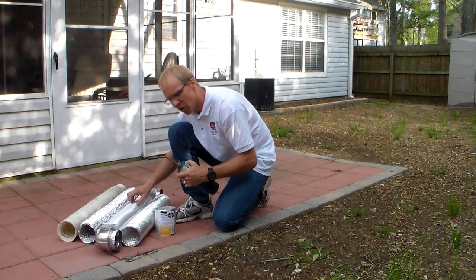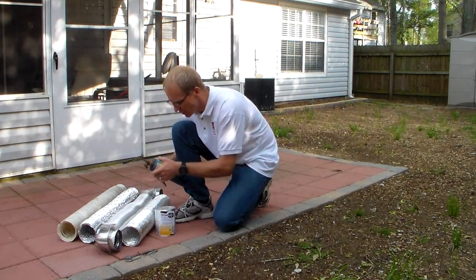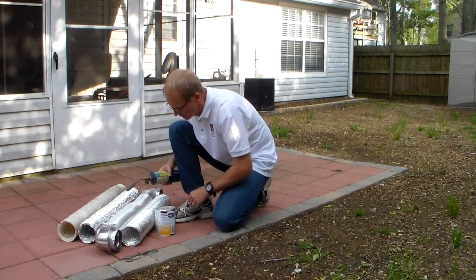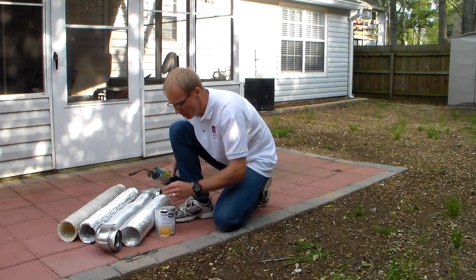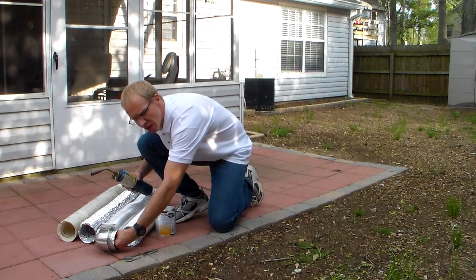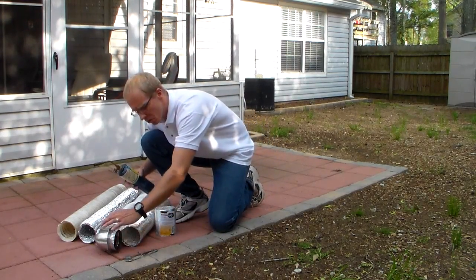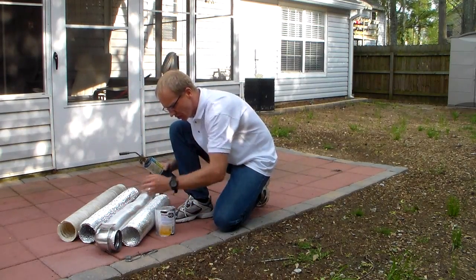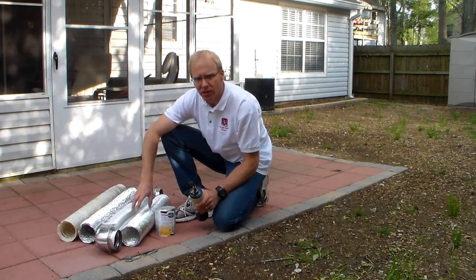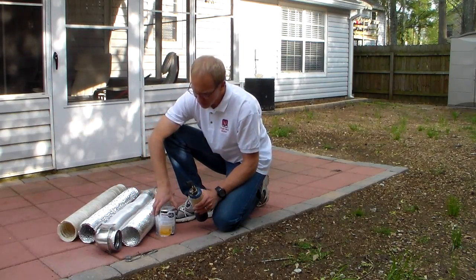The next one: hard, rigid aluminum metal. Very good one to use. You can see it heats up but no fire — it's safe. If there was a fire that started in this transition hose, there's a good chance that it would be contained inside here and possibly go out. This is a good choice to use for a transition hose.